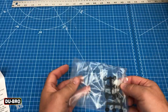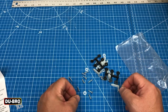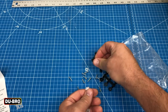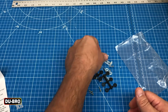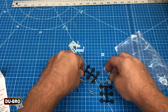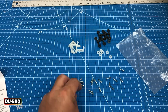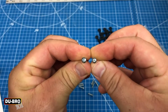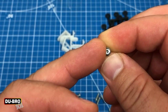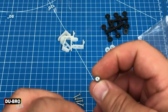The first thing I want to go over is the parts included in the kit. There are a bunch of screws and molded plastic pieces, and it's important that we go over each one. You have the main white plastic standoffs — these are the pieces that will actually connect the cowl to your model. We also have the white washer pieces, the molded black rubber pieces, and a bunch of screws. It's important to know there are different types of screws with two separate heads. The hex head screws are used on the outside of your model — they create a more finished surface and allow you to use a hex driver, which is less prone to slipping when installing or uninstalling your cowl.